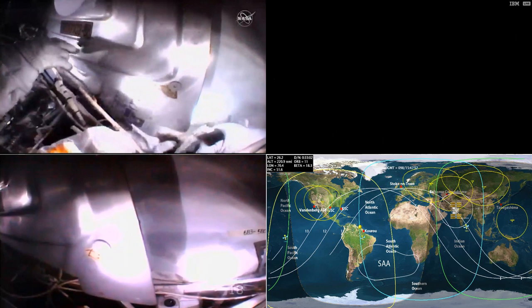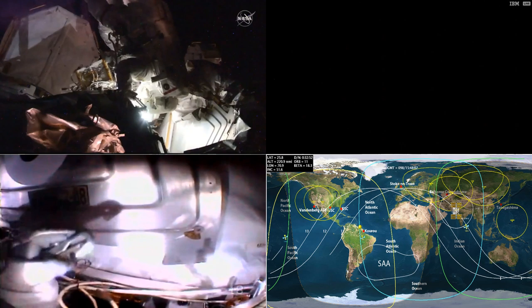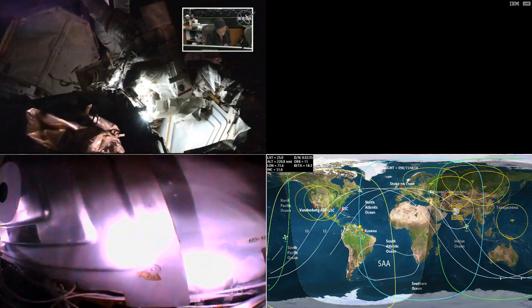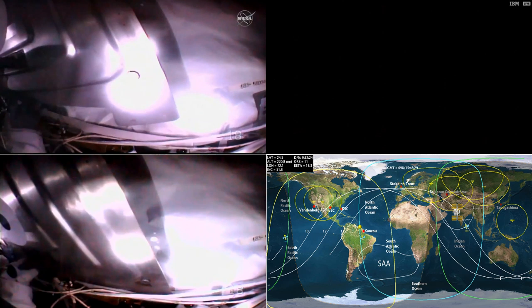That's good. We can slide this over. So this is connected on an AET. You see the long T-handle tool? Yep, see that? So, Ann, you should retrieve the long T-handle tool with your mini workstation end effector or Davit. And just a quick reminder that the Zeus fasteners have to be connected in proper order. You have to do the center Zeus fastener first. Yep. Right, so there's a tether from the lead workstation to the long T-handle now.